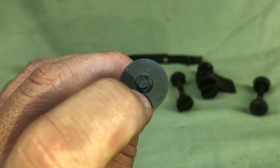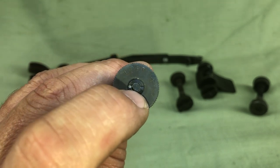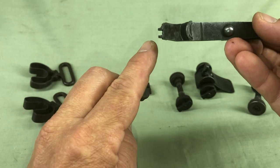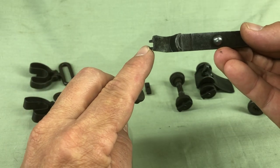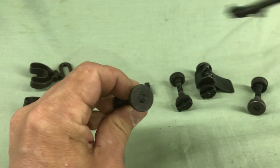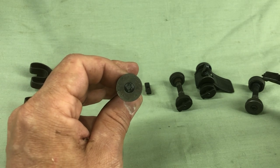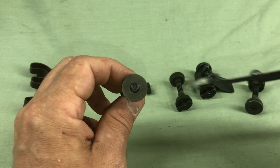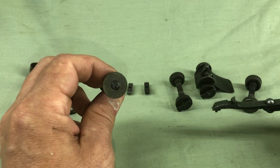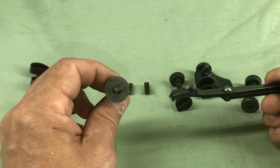The lock bar started with something called a locking nut. This outer portion spans over the pinion itself, and behind it is the bushing, spring, etc. You needed a special tool — like a little spanner wrench that came with the rifles — to unscrew it. The thread on this pinion is different from the later stuff; it is a 6-40. When they changed over to the square lock bar, that's the type 3. The round lock bar was the type 2.